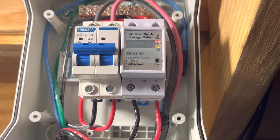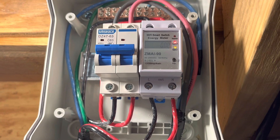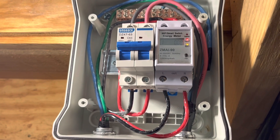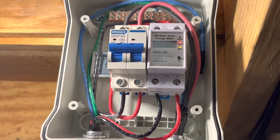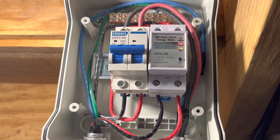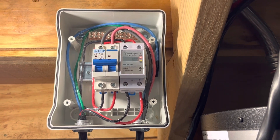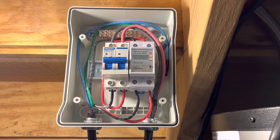The reason I've done this project is so I could control when my hot water heater is on and when it's off. I prefer to turn it on during the day when I have plenty of sunshine and let the PV heat my water versus running it off the battery. Because on a good sunny day my PV array is capable of producing more power than I can consume inside my home plus charge my battery. So if I can limit my water heater to running only during those sunny times, that will obviously reduce my power consumption.